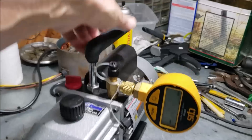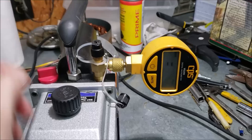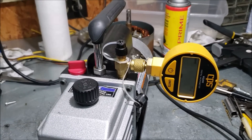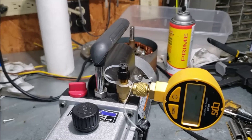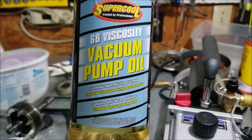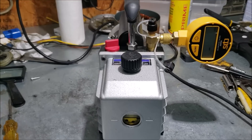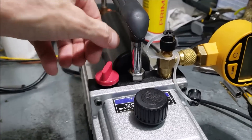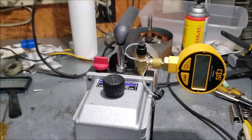I'm going to pull this down and note the numbers. Running it earlier, it pulled down to about 94 microns, which is pretty low - you usually won't see that on a system. Usually the lowest you'll see is around 300 microns on a residential system. According to the manual, I'm going to do an oil change. I've got oil ready because tomorrow I'm installing a two-ton compressor - it had a terminal blowout. So I'll let it run, get it warm to about 100 degrees, then drain it. All we need is a 10 millimeter wrench on the bottom.